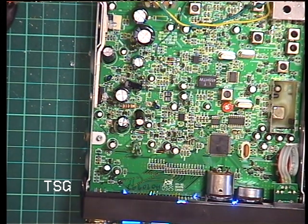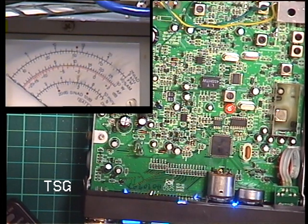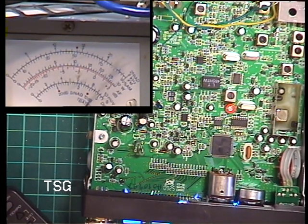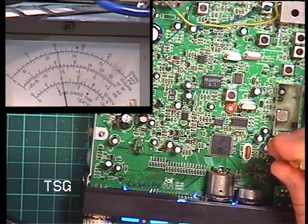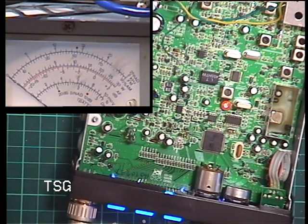So we'll just get our little oscillator out, set it to somewhere near. I'll put that camera back on. So 2.5, which is our maximum, is about there on the meter. So we want to set this to about 2.2, I would think. There we go. Now I'll just do the whistle test again. Make sure it's not over the top. Wallow. Wallow. It is just over the top, so we'll just backtrack on that. Wallow. That's excellent. That's spot on.